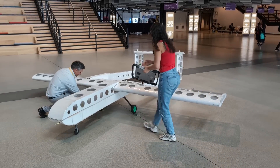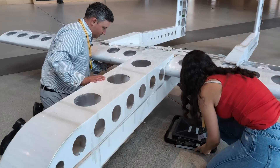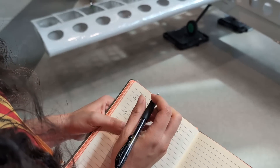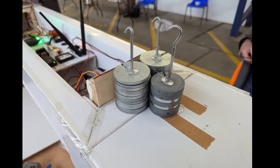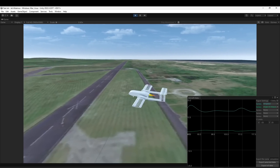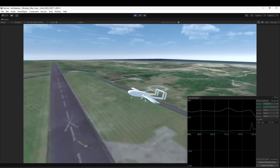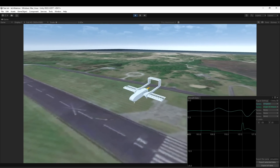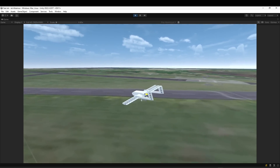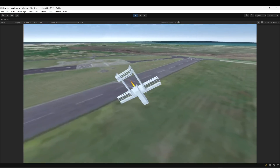There are a lot of checks to do before being ready to fly. One of the most critical is the centre of mass check. With the aircraft fully assembled, weighing scales were put under each wheel and the location of the centre of mass was worked out by taking moments about the leading edge. Additional ballast masses were then added to move the centre of mass to where it needs to be for the aircraft to balance in flight. A flight simulation model was built using the aerodynamic objects toolkit in Unity. The simulation allows evaluation of the flight dynamic behaviour, provides a tool for evaluating the autopilot without flying, and is useful for pilot training — particularly for recovering the aircraft when things go very wrong.